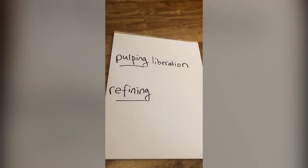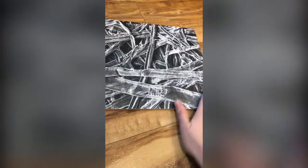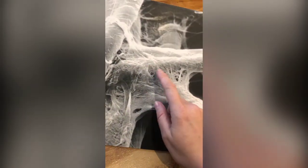One way to remember this: pulping is the liberation of fibers, coaxing them apart from each other by chemical, mechanical means, or a combination. Refining is fibrillation. Here's the surface of a piece of paper magnified 600 times — you can see the individual fibers all overlapping each other. Those little guys are fibrils — this is external fibrillation. You also have internal fibrillation. This is what you're doing when you're refining: you are working the fibers to increase the bonding areas.